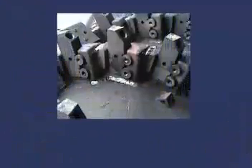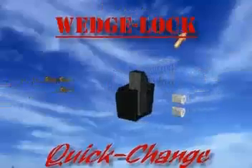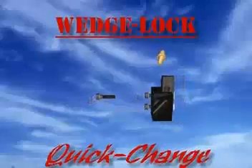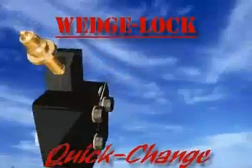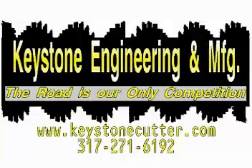Keystone's continuous cut mixing action head uses our own patented wedge lock quick change system. The wear part, or the block as we call it, is held under the flighting by two tapered wedges. Two bolts then pull the wedges into the block. A third bolt is used which goes directly through the flighting and into the block. This eliminates the need for any infield welding when a bit holder breaks. The replaceable block is positioned on the wear side of the flighting so that it's the part that takes the brunt of all the wear. That's why wedge lock systems with over 10,000 hours are still in use today. And this is the reason that Keystone is the one and only manufacturer to offer a two year warranty on its flighting.